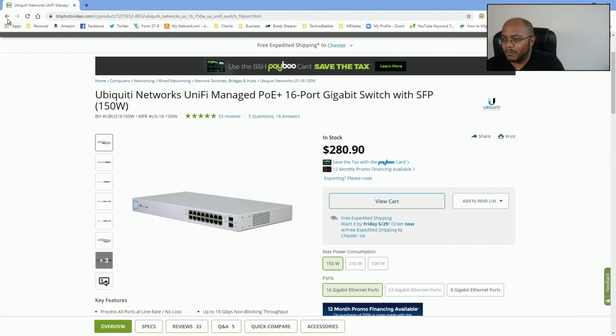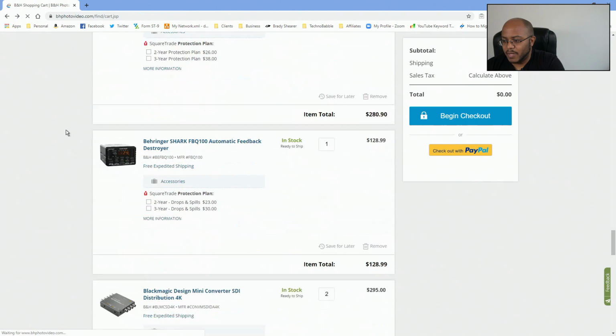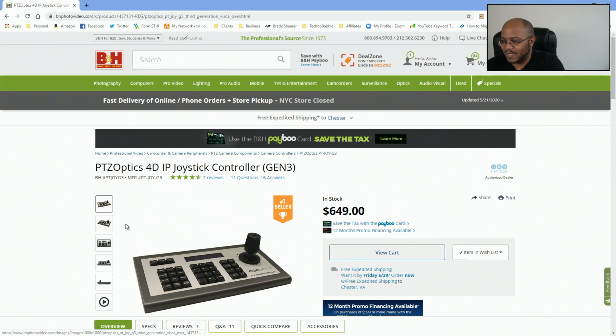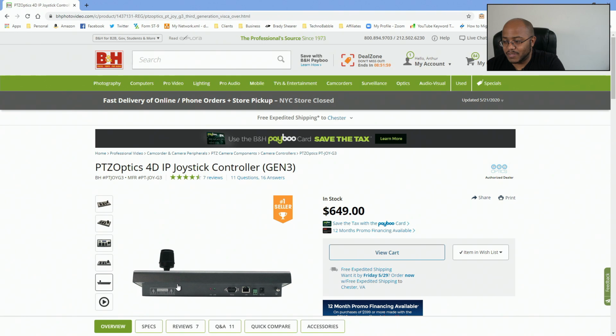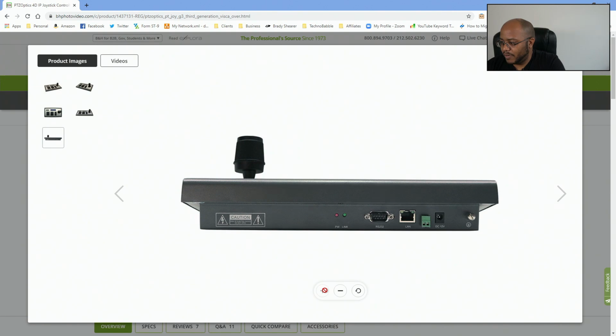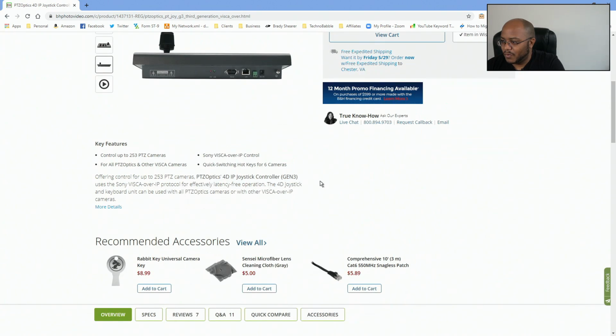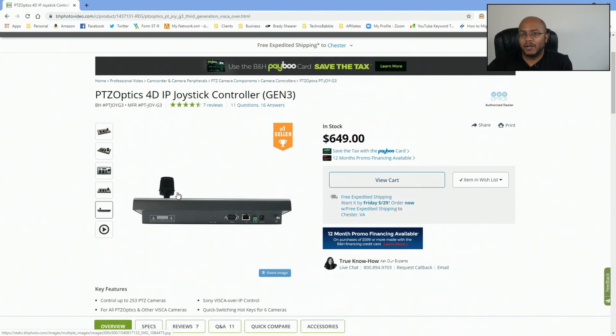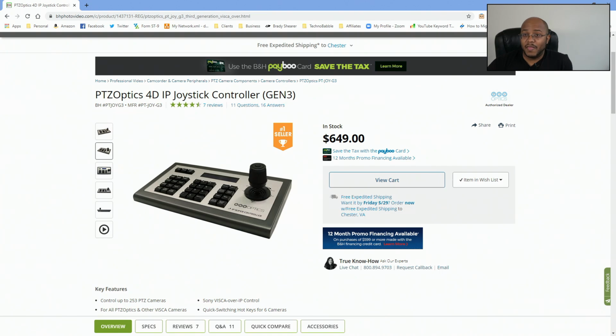All right, and then for our remote, same remote I've used in many other times is the PTZ Optics 4D joystick. It's actually the exact same one, similar to what I installed at Good Shepherd and Liberty Baptist Church. It looks exactly the same. The only thing they did, they added a RJ45 LAN port in here, because actually the RS232 and the other jacks don't even work. They even say it in the description. Yeah, the controller works only over Ethernet. So you plug this in over Ethernet, plug the other cameras over Ethernet, and then you put in the IP addresses, and then they can control each other. So that is the setup.